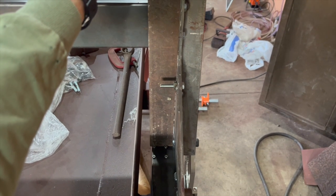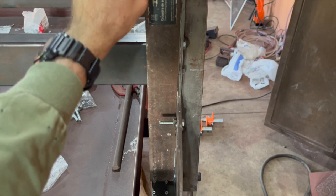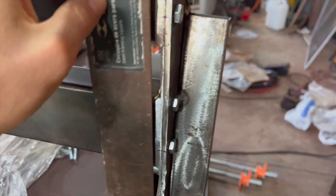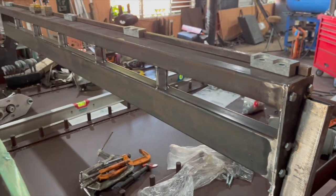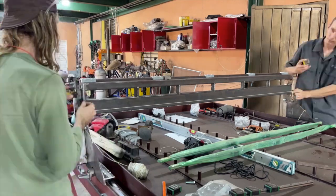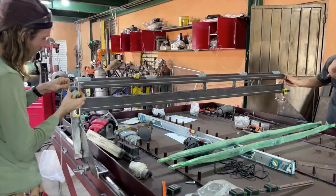I'm using a straight edge to measure off of the linear rails at the bottom. I've put some marks here and there, and we've done the same thing on the other side of the gantry over there. We'll just use the string line and paint technique again.